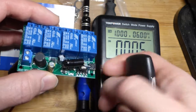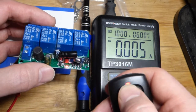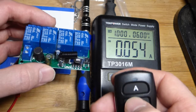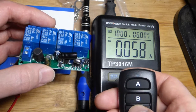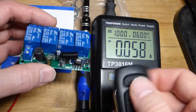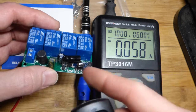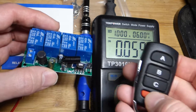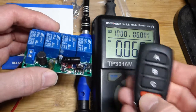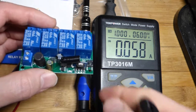Let's quickly do three presses, then press A. That's energized. I think this is the one where A energizes, but then B energizes and A turns off; C energizes and B turns off; D energizes and C turns off. It looks like we had that setting — only one relay is energized at a time, cycling through them sequentially.